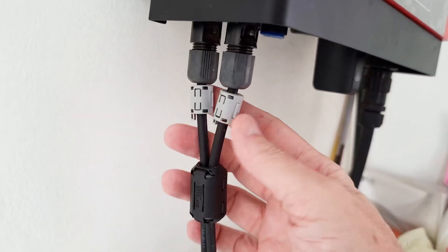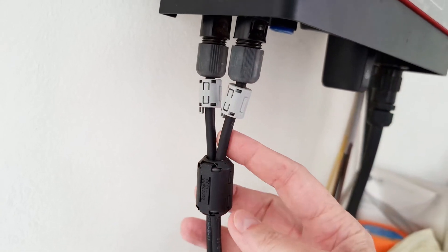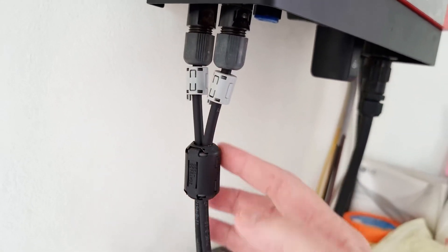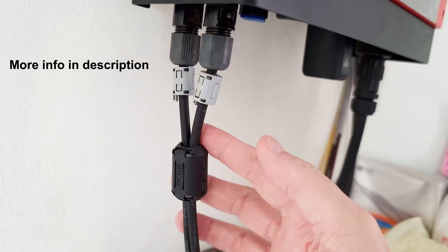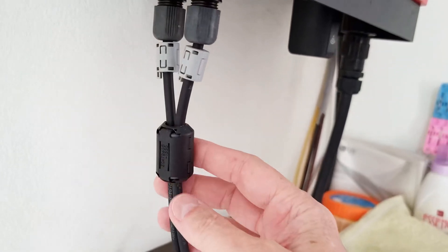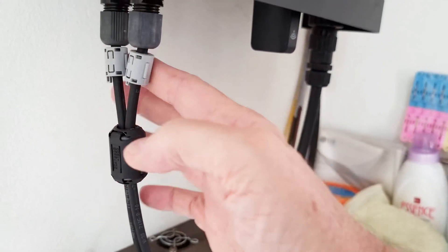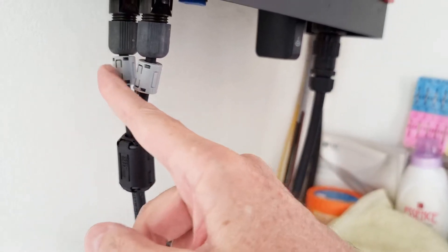I happened to have these filters, and as I did more reading I found out that RFI filters work better if you cover both the plus and minus leads together. So I bought a bigger one and snapped it on the outside of there. Let's take a close-up — I'll put these down on the table and we'll do a close-up of those.